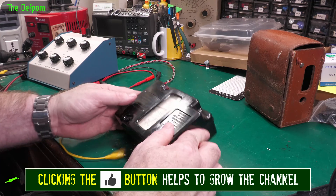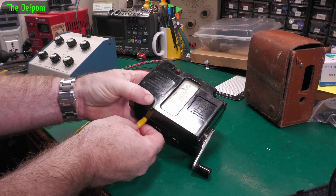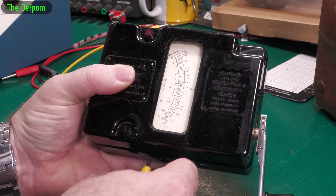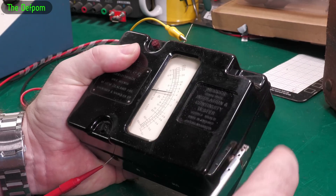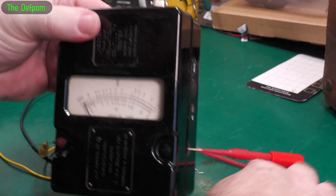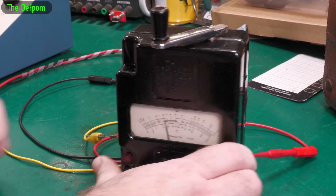So I've spent some time cleaning it up a little bit, and I thought I'd try a larger resistor. This is a 4.7 megohm. I'm going to use a clip lead for this — it's not ideal, but it will give us something. Now 4.7M should be just over mid scale. Change setup, try again. There you go — so it's supposed to be 4.7M. If I can get it to stay stable enough, let's try it this way. Pretty accurate — that's surprising.